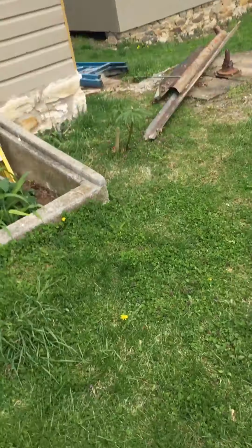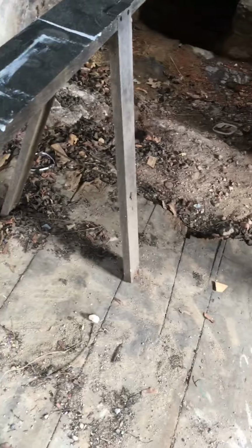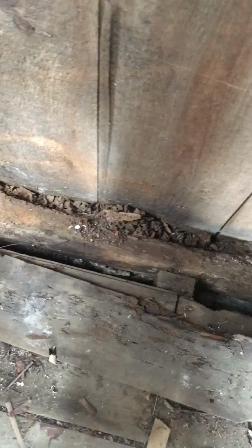When we're done with this, for construction manufacturing, we are going to continue on with the blacksmith shop. And we're going to put in a new floor in here. So right now you can see this floor has issues. I know there's at least a cat that lives underneath this floor, so we can be ready for some surprises as we go through here. You can see the one rim joist here, the rim joist around the edge there is all dry rot and decomposing and has to go because these are not attached very well right now. There's nowhere to attach them. So when I have this all out, I'm going to have to address all this.